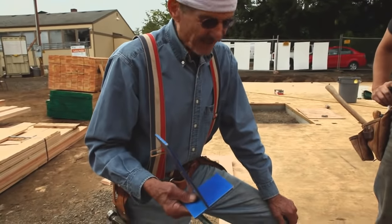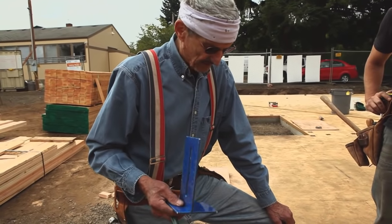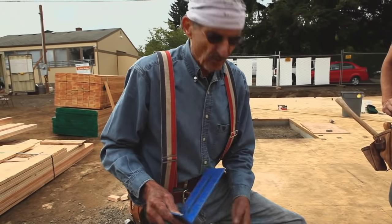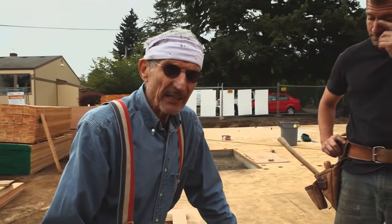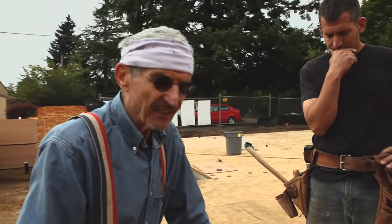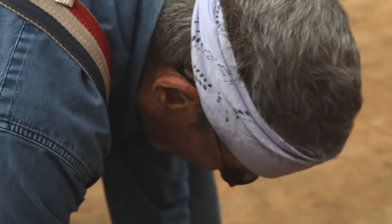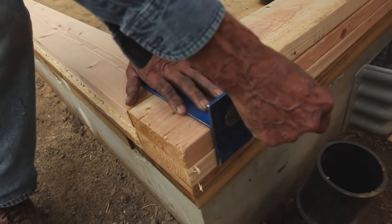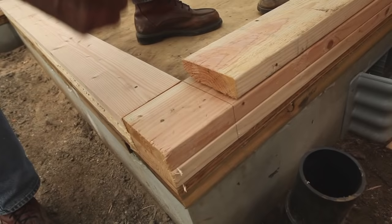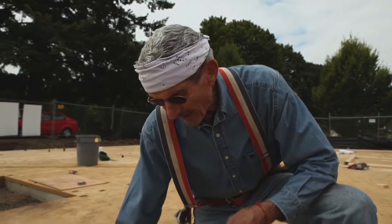This is a corner and channel marker, and you can make one — we'll make one in a bit here. If you don't have this, you can make one out of wood real easy. This tool is used to mark the location of where the butt wall hits into the through wall, so when we're framing we know where to put our studs and we won't get things in the way. So we lay that on the corner like that, and we mark here, and we mark here.